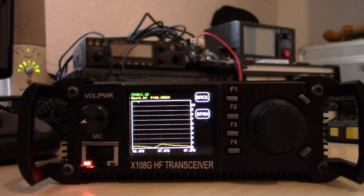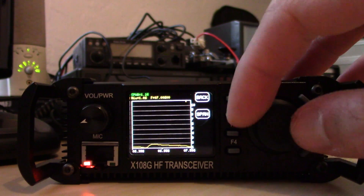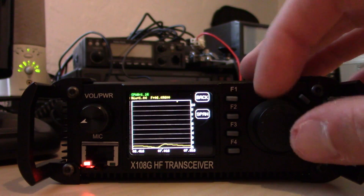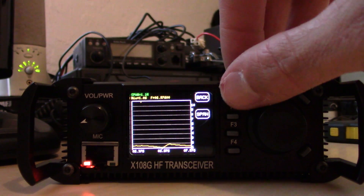It's spanning from about 6.4 MHz to 7.6 MHz and shows my SWR. I can move the cursor — and it rescans. There's my center frequency in the middle. Going down to the CW portion, my antenna is actually lowest SWR around 6.9 MHz, so I'm a little short.